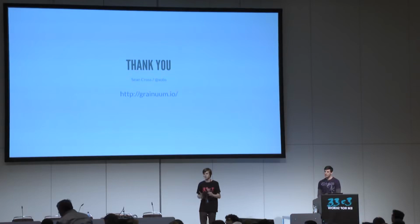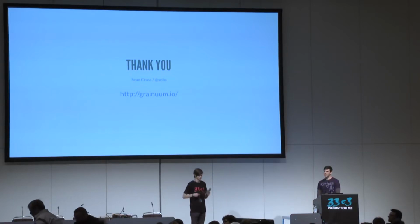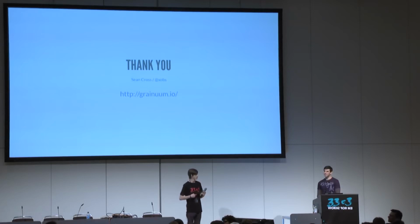Awesome. Questions from microphone number two. Hello. I have a question. So I'm wondering if it's simply the amount of cycles and the speed of the Cortex-M0 Plus processor that's limiting from implementing this in high speed, or is high speed USB significantly more complicated? I think the question was if it's the number of cycles that's limiting implementation of, I think you mean full speed. Full speed is the 12 megabit version. High speed is 480 megabits. Yeah, I'm asking about high speed as well. High speed, okay. All the way.